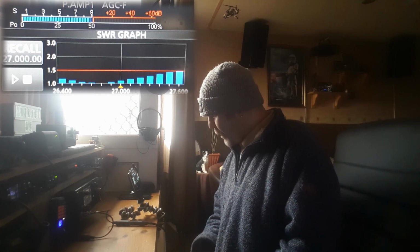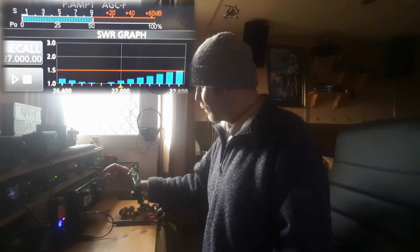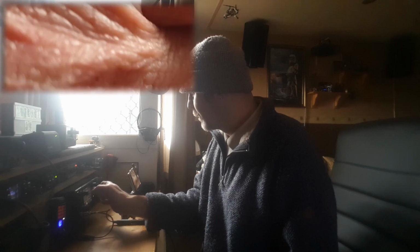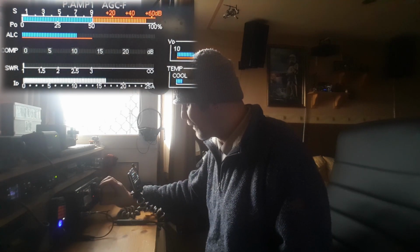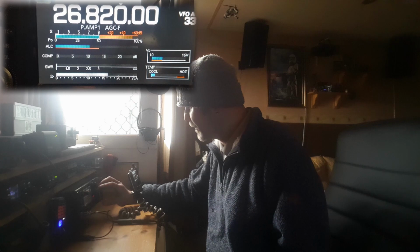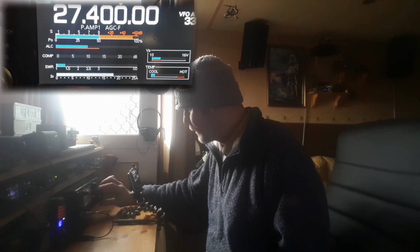So where am I low? Well, I'm happy to take that. It looks like it's going to be pretty low down. And let's have a look at the meter. Right, 26.760, I'm 1 to 1. Let me just zoom out a little bit so you can see the frequency. 26.820. So if you just have a look at the SWR.